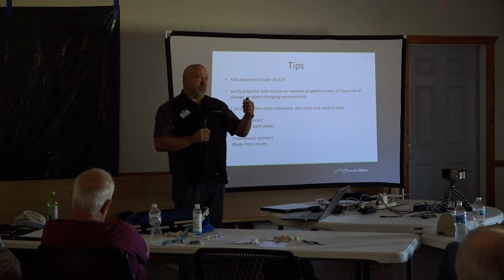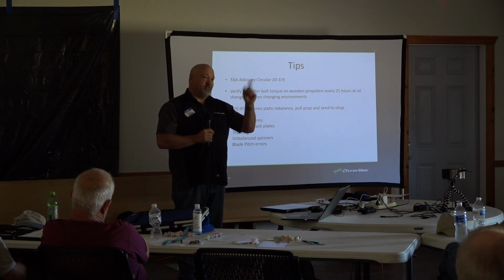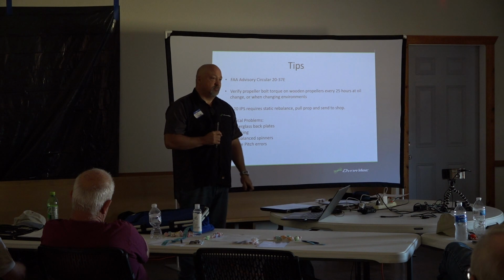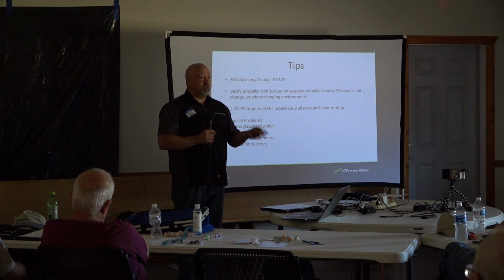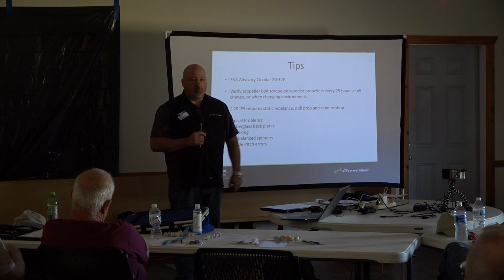Now, if it's offset, if it's a chord-wise error on a two-bladed prop, that can be a challenge. You just have to look at every case. That's one of the things, we've seen a lot of these. So if somebody has a DynaVibe and they want to balance something tricky, just call us. We're always available to help.